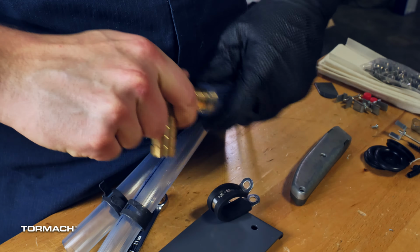Install the washdown coolant filter. Find the washdown coolant filter included with this kit. It's installed next to the washdown coolant pump on the coolant tank. We found it easier to angle the filter tank forward for easier access to the bracket. Secure with 4 M5 by 10 flange button head cap screws and a 3mm hex wrench.